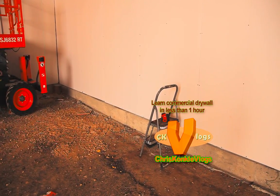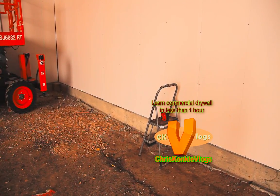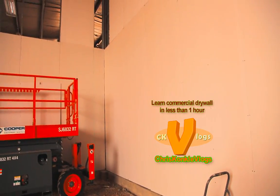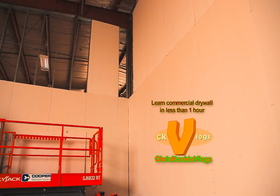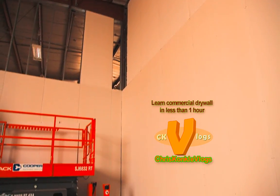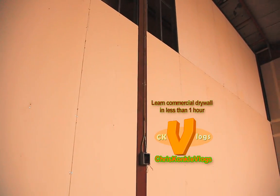All right, so what I'm demonstrating right here is when we're putting on our 10-foot tops, you still have to laser level in the first one. You can see what I mean by that. We got our first 10 up there, and we have the laser line showing us that it's perfectly level. And that's a good thing to do always. So I've done that on every bay. On each bay, I laser leveled the first top. All right, now I also got the numbers drawn at the tops, ready for my cut-ins, which I'll show you next.